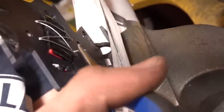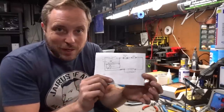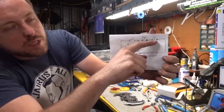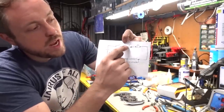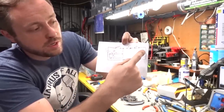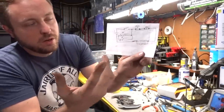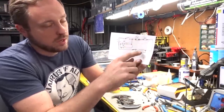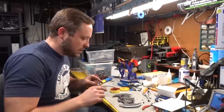I'm going to throw some wires on this thing now. The circuit is relatively simple — I have a real circuit diagram. Here's the battery, then an on-off switch. Once the on-off switch is turned on, it turns on two LEDs. The two limit switches are wired normally closed, so when you turn the Batarang on, you need to have one of those switches held down. Because they're wired in series, either one disconnects the rest of the circuit, which runs to wire terminals where the rocket motor igniters connect, then back to the battery. You turn it on, the LEDs come on to let you know it's armed, and when it's armed you have to have one of those switches pushed down — otherwise the rocket motors fire.